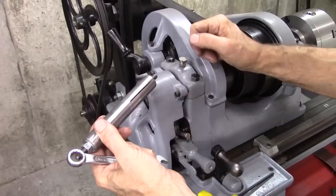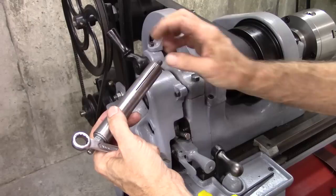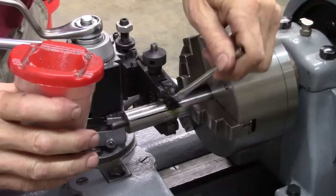But I'm going to run a knurl right there and try to expand that. I'm going to run the knurl over the top of my bandsaw cut, which I don't know if that's going to work out real well. It may make an ugly knurl, but it might be enough to expand that shaft to where it's more stable in the spindle. So we're going to give that a try.